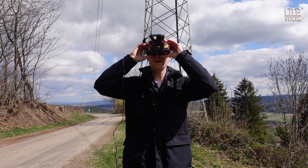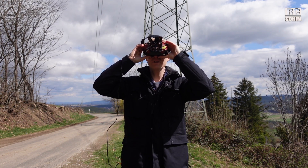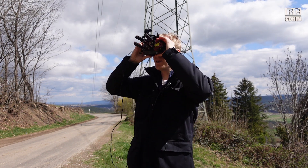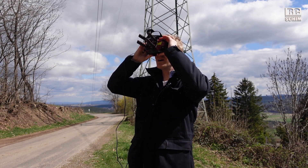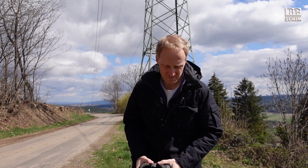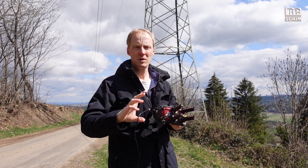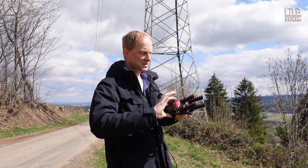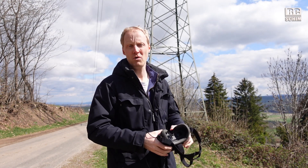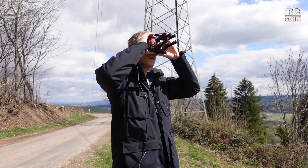At 45 degrees we got only 0.3 megabits — not a lot. So at 90 degrees I won't get anything. Connection dropped. Of course they are more directional than the three-turn helicals, which is expected. But what I didn't expect is that I don't get anything more in terms of bitrate out of them — that's kind of a shame. Only 4.7 megabits.